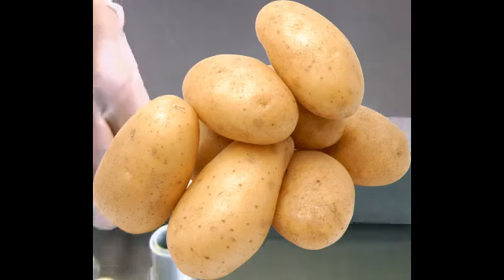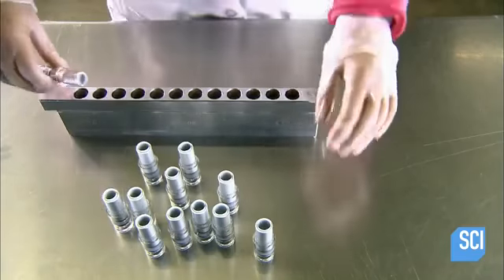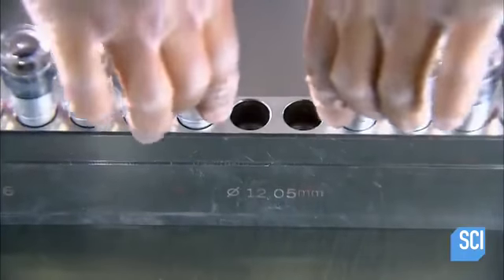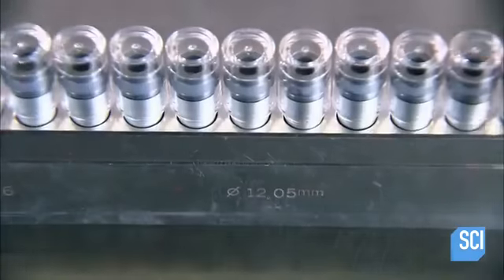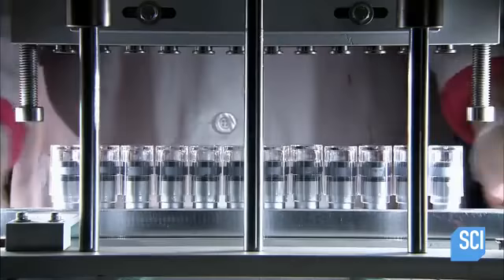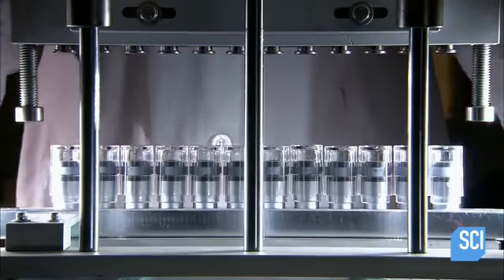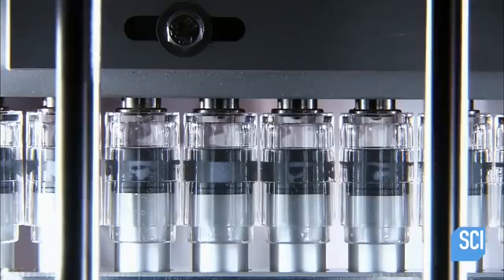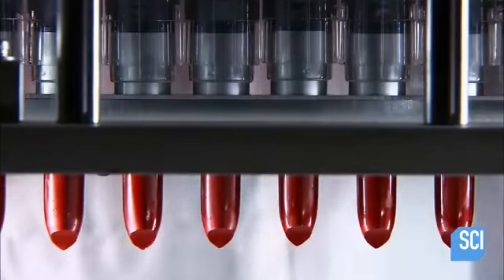The lipsticks are now ready for their swiveling tubular cases. She places a rack on top of the mold and inserts the cases into slots in the rack, which are aligned with the lipsticks in the mold. Then it's over to the bursts-of-air machine, where bursts of air gently push the lipstick out of the mold and up into the cases. To assist, little pushers apply pressure to the bottoms of the cases.